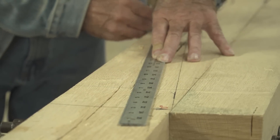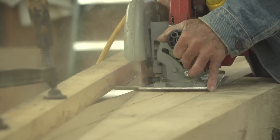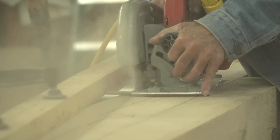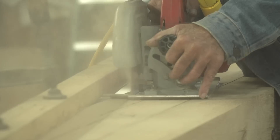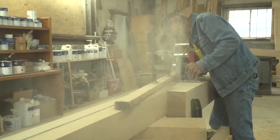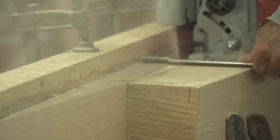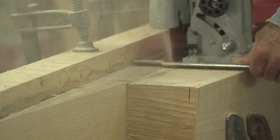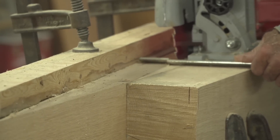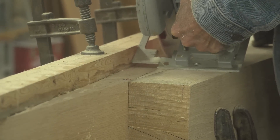I set this one up very much like I set the last one up — I have a block alongside as a guide, just a piece of oak clamped down on top. Without it I couldn't follow that line; the saw handle's not in line with the blade and as you push it, it wants to twist. I use an old Milwaukee saw — it does the job, it's got plenty of power, and they last forever. Sometimes I have to actually pick the saw up and plunge it back down into the same cut, or make a shallower cut by taxiing along on the front of the plate. It's pinching because there's set in the tree — as you cut it, it's trying to close that set up. Sometimes they want to spring off and sometimes they want to spring on.